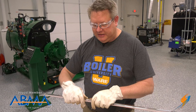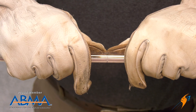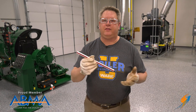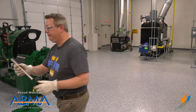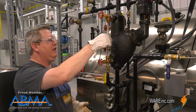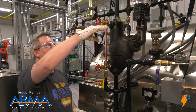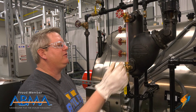To snap the glass, you put your thumbs opposite the score mark and just do a quick, confident snap. Once I've cut this, I'm going to go over and make sure it fits before I put the gaskets on, in case I measured wrong. I'll do a quick fit-up check. As you can see, that actually sits up in there and then falls back down. Cutting it long like that gives me plenty of material up in the top for my gasket to seat.